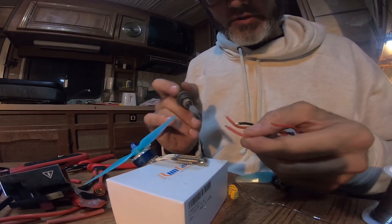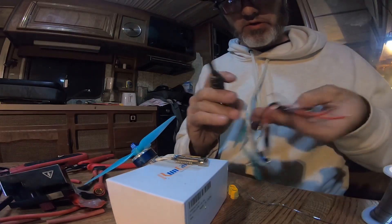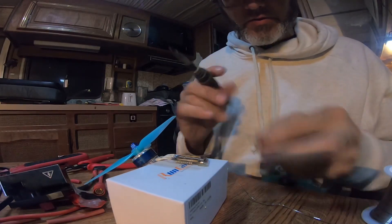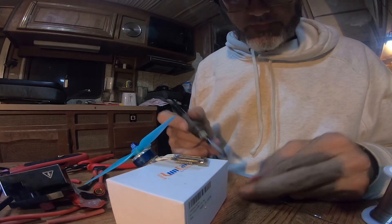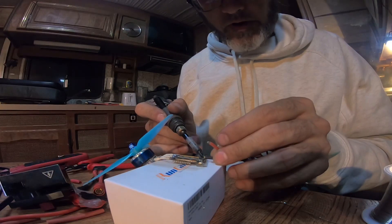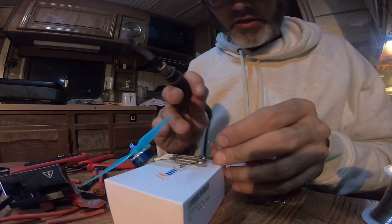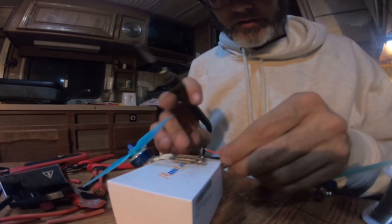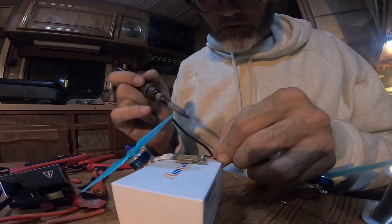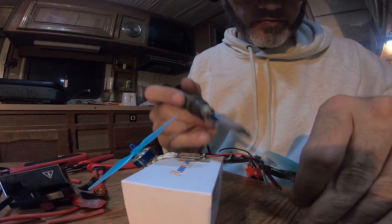What I like to do — normally it's not stuck like that. I better make sure I know what's what — positive is on the top. Normally it's not stuck down with tape, so what I would do is solder one wire to it so I can control it. Right on top of each other, hold it on the top wire till it melts through, pull back, call it a day. Then do the signal wires — the signal wires you put in your iron like this, should be real careful and quick.